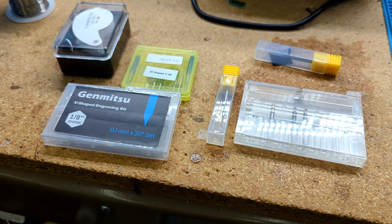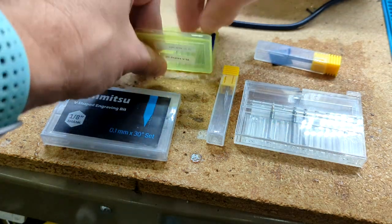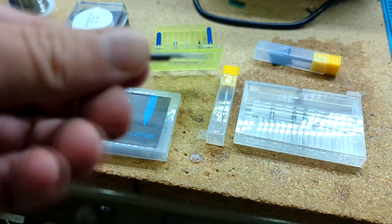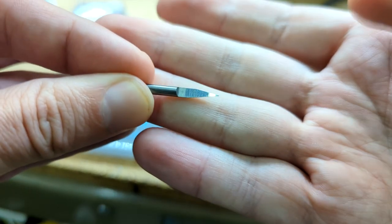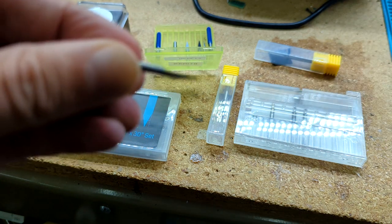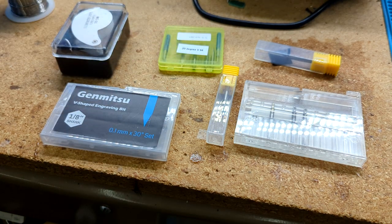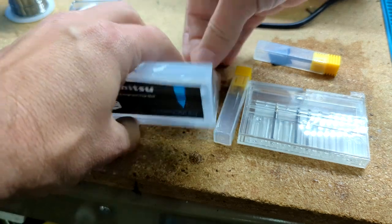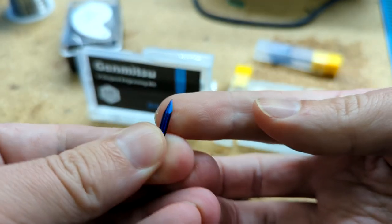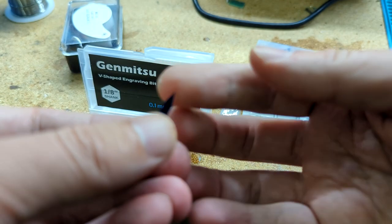Here's a bunch of bits that I would consider viable choices — they all have their trade-offs. These are cheap 20-degree flat-cut bits that come with the machine. They are cheap and they don't actually have cutting flutes — it's just cut off flat. These work and they can make fine detail, but they're not really designed for the job, so you'll be breaking bits a lot more often. The 30-degree bits are basically the same thing except for the angle, and they work a little better but the tip is still quite fine and easy to break.